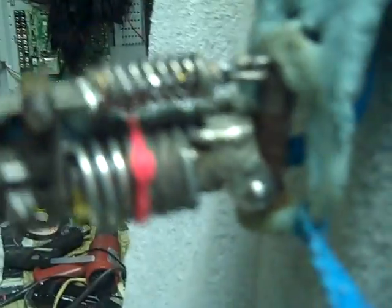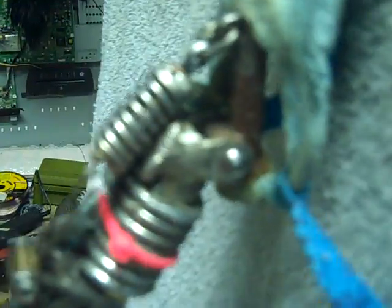Now watch that load spring. There's another load spring here, in case the kid grabs it and pulls it to the side, you can see right here. There's also a clutch inside that thing to keep the tail erect. With all that padding, you can see the vertebrae right here. Tie straps, anything I can lay my hands on. You can see the spring being loaded. You shut it, it works.